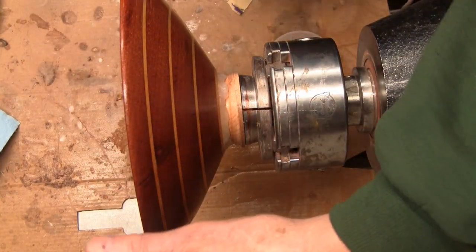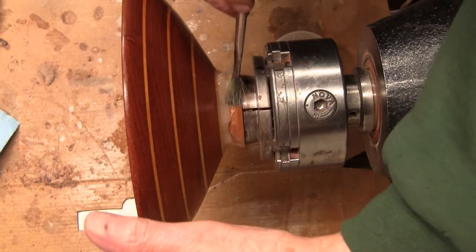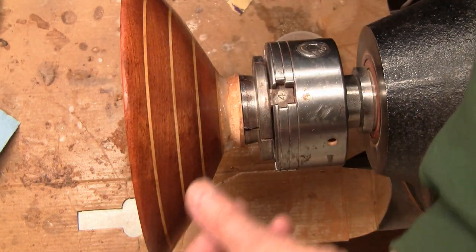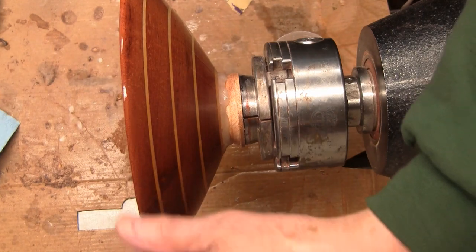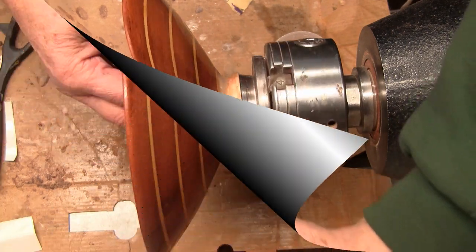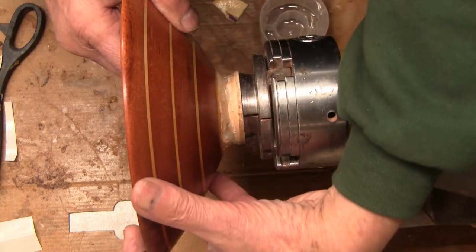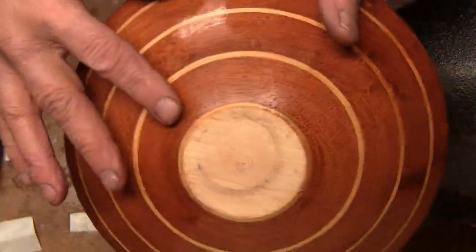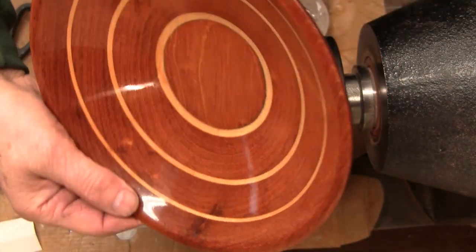Let's see if we can get that hot glue tenon off. I'm putting denatured alcohol up against the hot glue and trying to get it to soak underneath — that'll usually loosen it up. I'll let it sit for a while and come back and do it again. I did use Axe Abrasive Paste and Polish on the finish — I have a video showing that process in more detail and I'll put a link in the description. After about ten minutes I can see it's pretty much loose — and it just came right off. You just don't want to be impatient; if it's hard to pull loose, it's not ready.